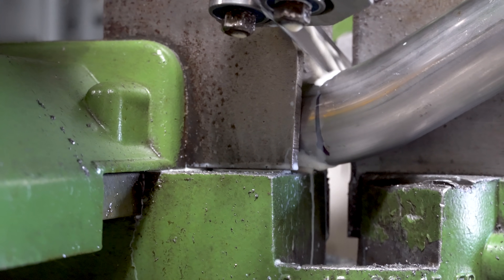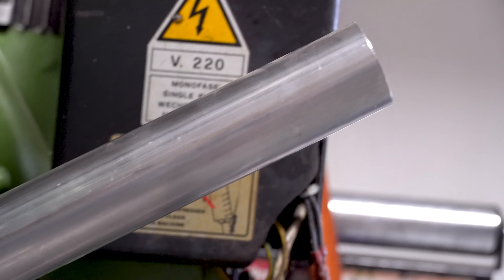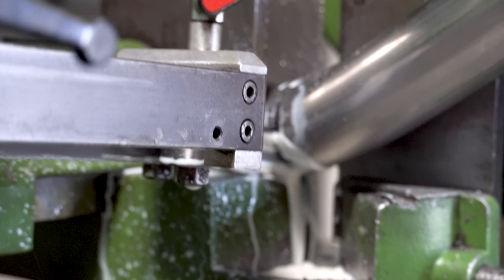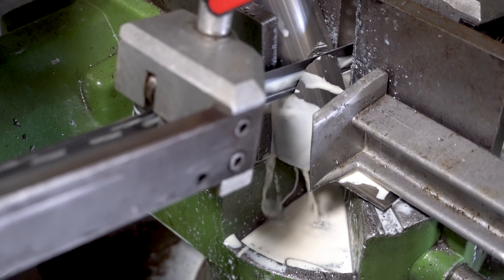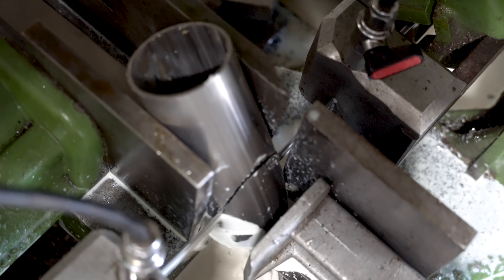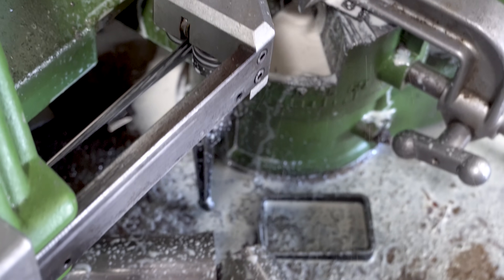It's time to get working on the manifold. I started with a 45-degree stainless mandrel bend from JMD Tubes — it's an inch and three-quarter round with a 0.065 wall. The stock is something like an inch and a half, so this diameter will flow a whole lot better. With the 45 now cut into two pieces, I cut them both in half again vertically to create the merge for the turbine inlet. The diameter is the exact same as one piece of tube, which is an inch and three-quarter round.